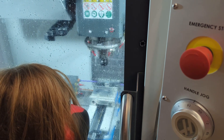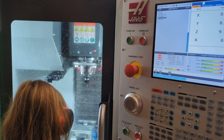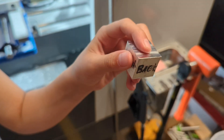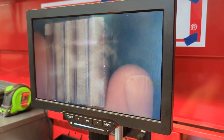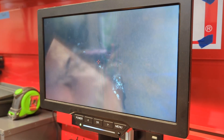One way or another you'll reach the end of your program and the spindle will lift up to G53Z0. When the program finishes entirely, the light will flash green indicating you can open the door. Use the vise handle to loosen the vise, pull out your cube, and pull out the parallels. Look at the surface you cut — feel it with the pad of your finger and your fingernail. Take it to the video microscope and look at it there too. Congratulations on getting this far: it is many, many preparatory steps to be able to load work, find it, and cut it inside a CNC mill.